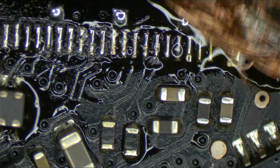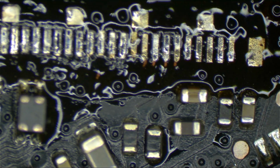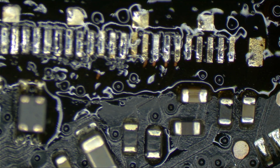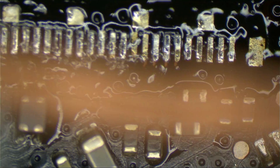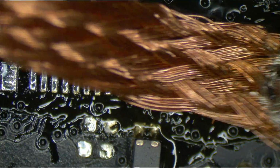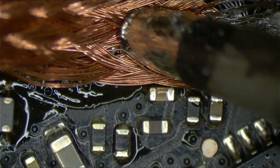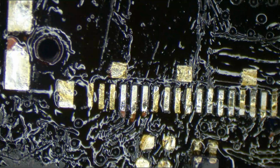You gotta realize that it is never the output capacitor, like 99.99999% of the time. It's not that. It's just that because of this video. And you would have been able to tell that with the short test immediately, by putting power on there. See, it's when I don't decide to use the power supply to find the short that the short is going to be somewhere where it would have been safe. And it's when I do decide to use the power supply to find the short that I'm gonna burn a hole in the motherboard. Oh, man. Can't make this shit up.